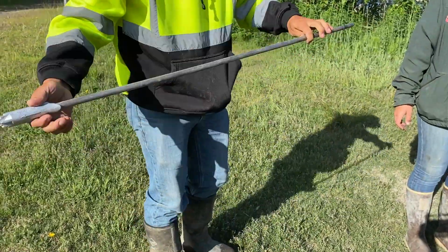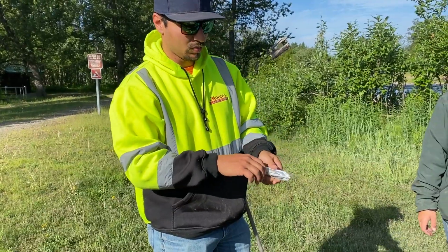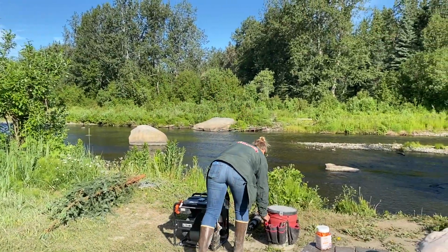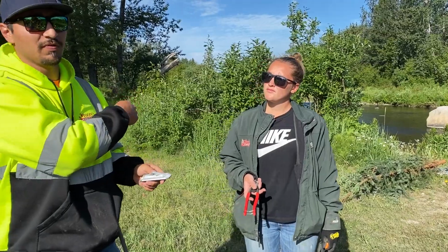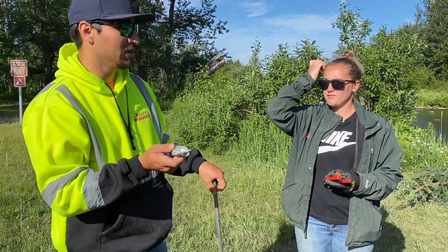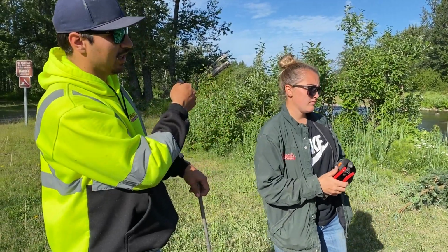So we'll do that, and we'll pull the bar out, and the person that's helping with the Hilti will wrap the cable on the pliers that we got, and you give it a good tug, and you'll feel it set. It'll pull it where it's not going to come out, and then you cut the cable and just go every 4 feet.